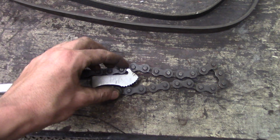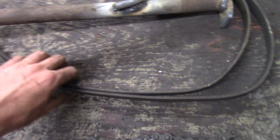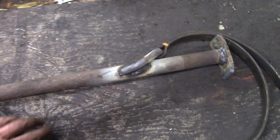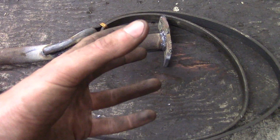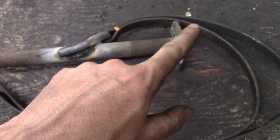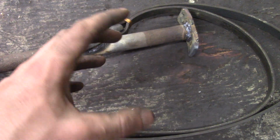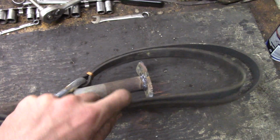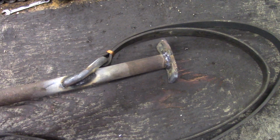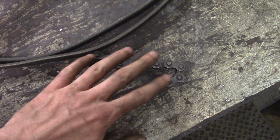Now the thing is, I have this small one. I've got a big super jumbo chain wrench, but it's nice to have just a lightweight strap wrench that you can use for lighter duty jobs, and I made this, and it seems to work pretty well. This is good for, for example, I'm working on my Massey Ferguson backhoe, and I need to bar the engine over by hand, but it's hard to get a screwdriver into the starter hole and move the teeth on the ring gear. So let's grab around the front pulley that drives the water pump and everything. But I just can't quite string this around. It's not quite long enough. So this is perfect. It's nice and lightweight. I can feed this strap around the pulley and crank the engine over that way so I can make my adjustments. And I don't have to fuss with a big heavy chain wrench.